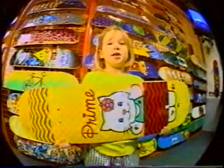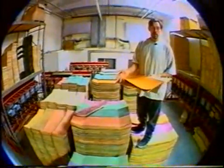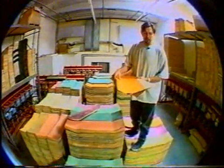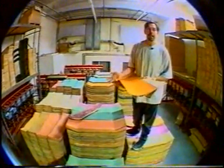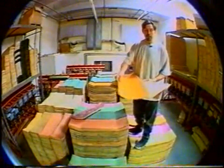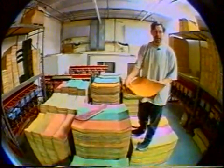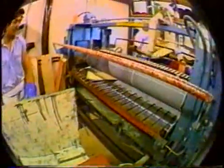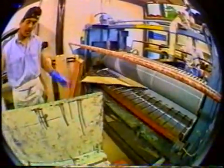How do you make a skateboard? We're here to talk about how a quality skateboard is made. Quality skateboards are made with hard maple veneer. Hard maple veneer comes from the Great Lakes region in North America. This veneer is solid and strong. You can see we use a combination of grain going in the width and the length to make a quality skateboard. This veneer is then run through a glue machine and has glue applied to it, and then it's put in a press to be pressed.